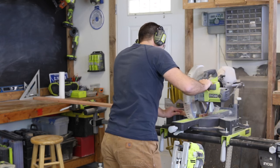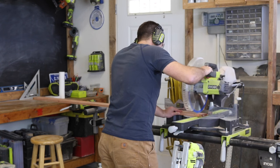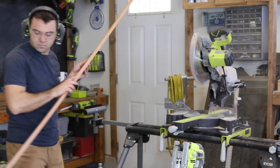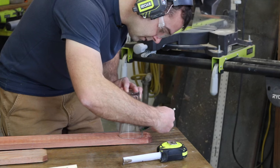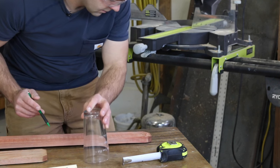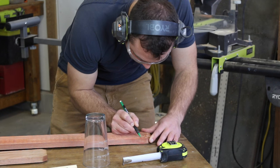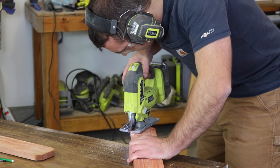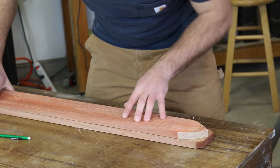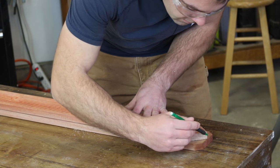We'll start by cutting the fence pickets to the height you want them to be. I used six-foot fence pickets that were three and a half inches wide and cut a couple inches off. To make the pointed end of the ski, I placed a pint glass on the board and traced a half circle, then free-handed a point toward the tip. Next, cut out the ski tip using a jigsaw. You can use the first ski as a template and trace around it so you get matching ski tips.